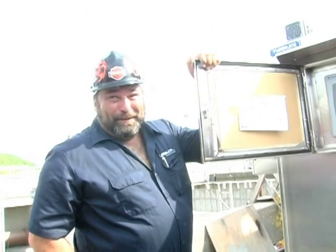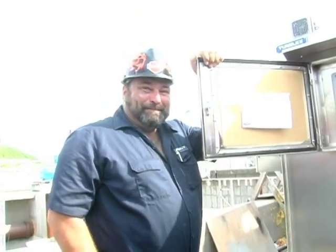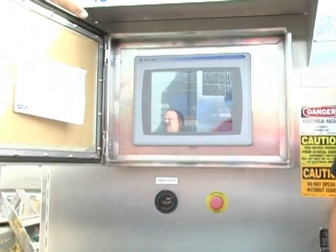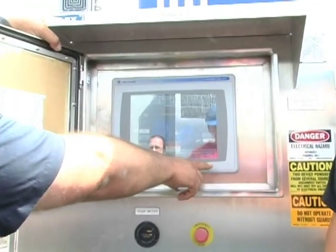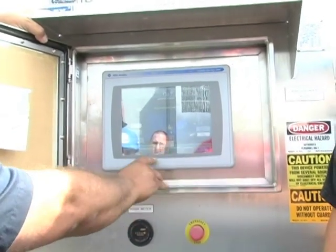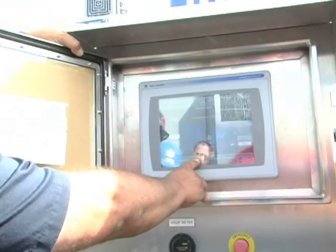If you have a failure to start, it's going to walk you through the probable causes — some of the stuff you're probably going to forget after we leave this meeting. That's something I'd say is one of the most important things to hang on to. Go down there and check it out. This is the local control panel, this is the main screen I showed you. The alarm was going off. There is a silence button so you can shut the buzzer off. You then go to the alarm trip display to see what it is.